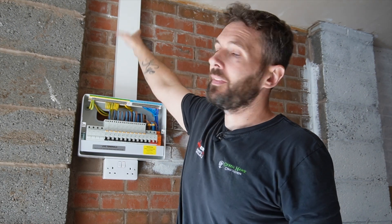So we've got to take that old board off and then put a new circuit in for this light. When you're working on any electrical installation, you need to make sure it is safe to work on at all times. The meter cupboard is just outside so I can't see it at all times, so you need to be using a lock-off device. A simple device like that will completely save your life and stop somebody else from turning on the power while you're working on it. Lock it off, label it clearly - do not operate - and leave your contact details there, because on a bigger site with multiple trades, they need to be able to get hold of you. Do not leave the key where anyone else can get it, because people are selfish and that could mean you won't end up getting home.